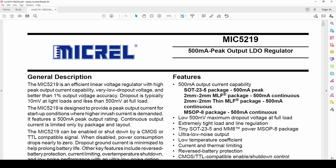Also, the LDO dropout is not constant. You can see on the left-hand side of the datasheet it may be as low as 10 millivolts at a light load, but at full load — 500 milliamps — the dropout voltage is 500 millivolts. So if I'm not running at full load I can get away with just a 10 millivolt dropout, which is very low. Other linear regulators might be up to one volt of dropout, meaning you'd need at least 4.3V input for 3.3V output.